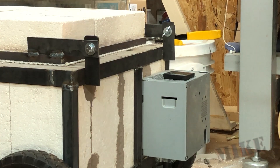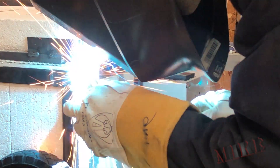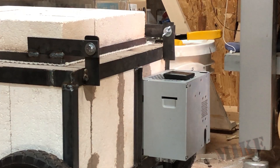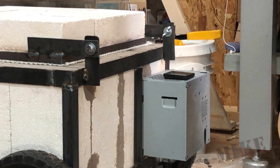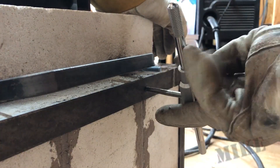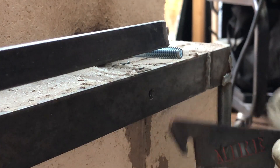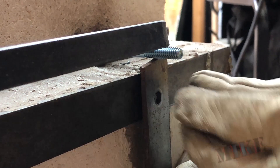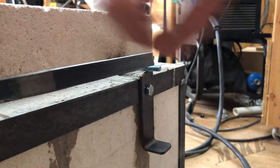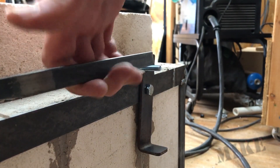For the lid pieces, I simply bolted them together and didn't weld them onto the frame because of alignment problems. This way they're bolted and they just kind of fall where they may, and then I weld them there — that way I don't have to worry about alignment at all. For the latch I'm repurposing the old one, but I've got to tap the frame here in the front so it can attach to that bolt hidden behind the handle. Here's my old auto-latch — I bolted it in to that hole I just tapped — and you can see that when I drop the lid it'll automatically close. Boom, like so — piece of cake.